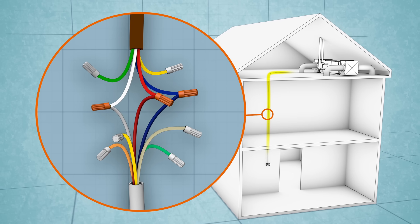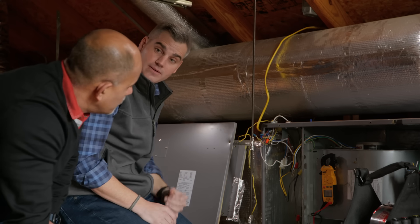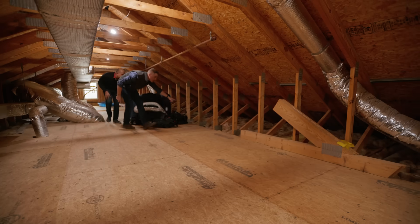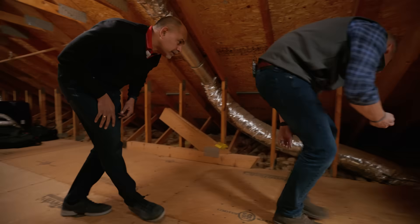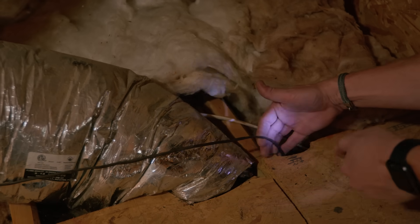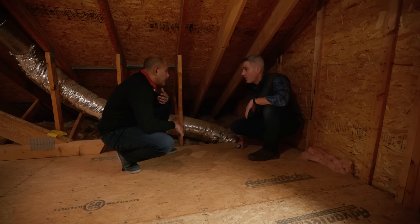How do we resolve that? The next thing to do is see if we can find the splice. We know it goes from here somewhere down to the thermostat. Let's trace for that and see if we can find the splice, and if we can, we can make the proper connections. So that brown wire — the thermostat wire — runs right across here, and then you can see it dive down right here and go down the wall cavity. That means that splice is happening somewhere in the wall cavity going down to the thermostat downstairs. So that's unfortunate, and now I understand why you were having some troubles. But I do have some solutions — let's go downstairs and talk those through.